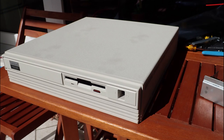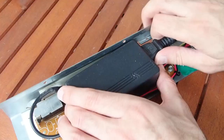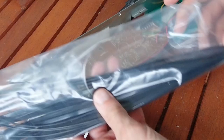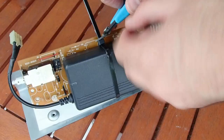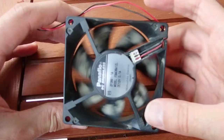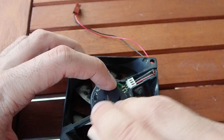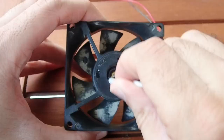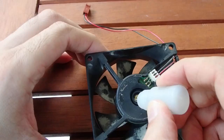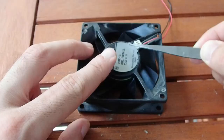To prevent the chassis from further rusting and to protect the polished surface, I sprayed some clear varnish on it. Now to the PSU, which I didn't fix properly last time. I bought some longer zip ties and this can now be fixed as was planned in the first place. The fan was very dirty but was running quite silent. As I opened it I found a metal brace holding the bearing inside, so I decided not to disassemble it and just oil and clean it from the outside.